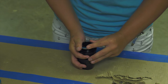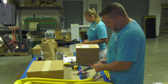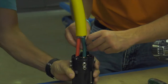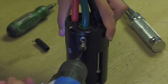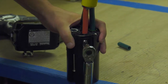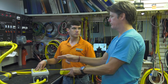The team at Ward's started by assembling the enclosures for the shore cords. While they were working on that, Steve taught me how to assemble them by installing the cables through the cable glands in the enclosure where all final connections are made. From there, it's off to the testing bench to confirm that the control was working and the phasing is correct.